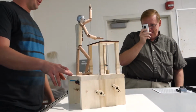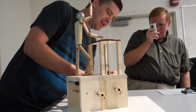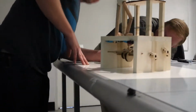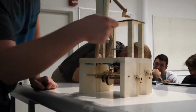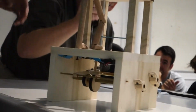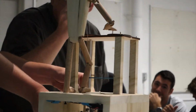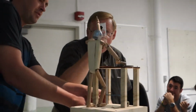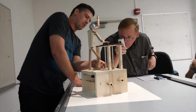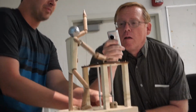And do I explain how it works first? Yes, and demonstrate, please. So I have a crankshaft with a pinwheel bevel gear that goes up into another axle that spins like a vinyl disc that also in turn moves his hand. Yes, it does. And then the rubber band reverses the motion on this axle and spins this vinyl the opposite way.